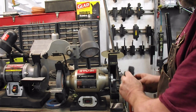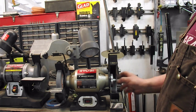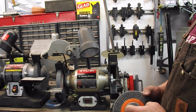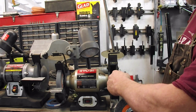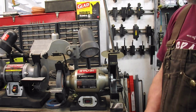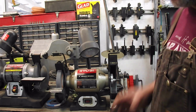But I'm going to trim that down because I need to go to 1.260 for the inside here. And I need to go to 1.930 for the inside here. So I'm going to make a double step on this. And, well, this one, actually I'm going to grab a new piece of 2.5 because I don't think I can make a double step out of what's left of this.